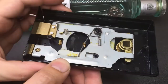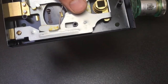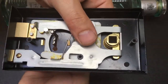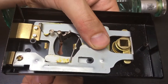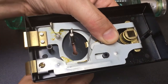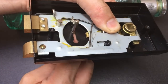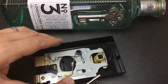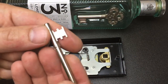There we go — there is no warding. If I put the key in like this, all it's doing is turning round, pushing that latch up, and then pushing the rest of the mechanism to one side. There's no warding, nothing needs to get around anything. These little cutouts on the side of the key really mean nothing — they have no significance at all apart from maybe aesthetically.